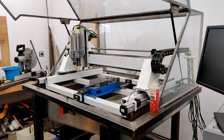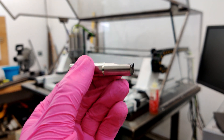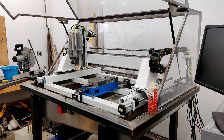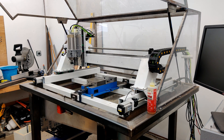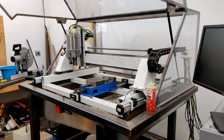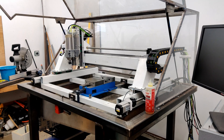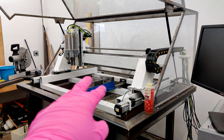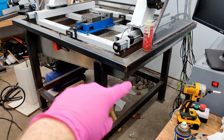In the last couple videos there was nothing but raw cutting, primarily with the BAP 300R with a regular carbide insert. What I found was, especially when doing the facing operation for the drill press vise — and I think that's iron, I'm not sure exactly what material it was — it shook the hell out of the machine. The gantry and gantry risers are all filled with grout so they're pretty rigid, but the rest of these tubes down here where the vise is attached, the whole frame — they're just hollow.